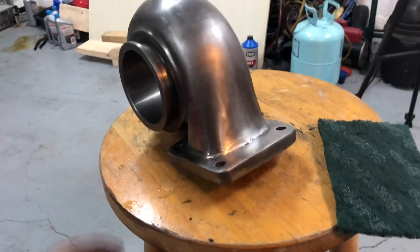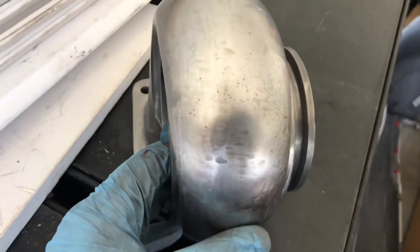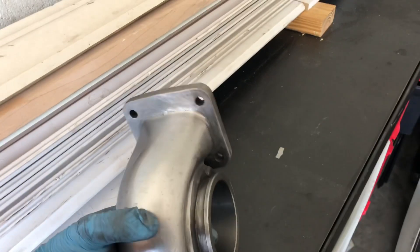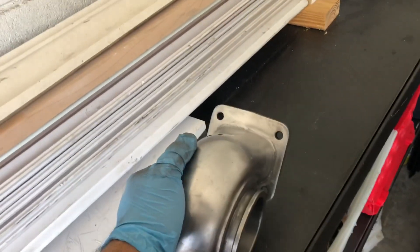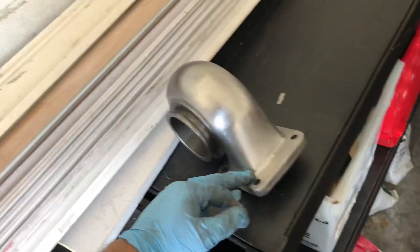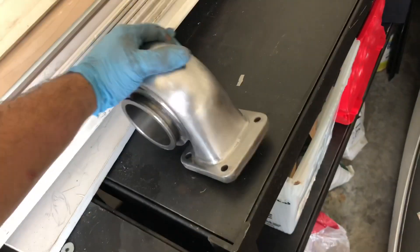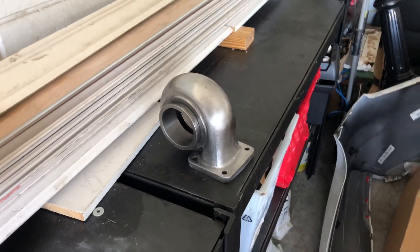Now with a piece of sandpaper I can go over it and get everything as smooth as possible. We're about to take this in for ceramic coating. I ended up sanding it starting with 100 grit because there were a couple deep scratches from the grinder. If I were to redo this, I'd definitely go with a less aggressive flap disc on the grinder and then do more hand sanding with a little sandpaper. We started with 100 grit, worked our way up to 400, and it looks decent. The main area you're going to be seeing looks good, and once it's coated it'll look similar but a little shinier since it'll have the ceramic coating.